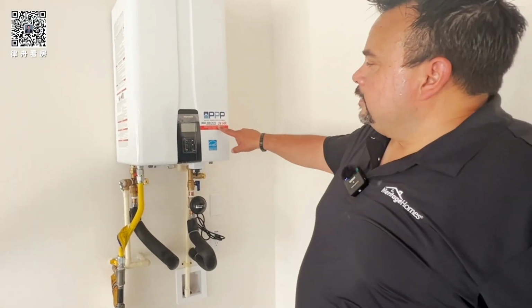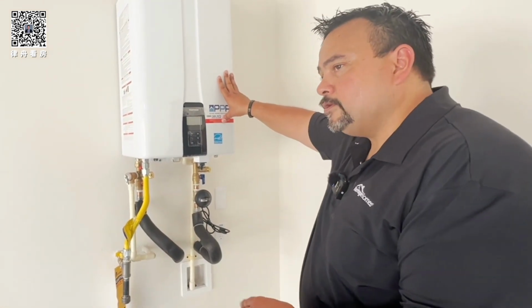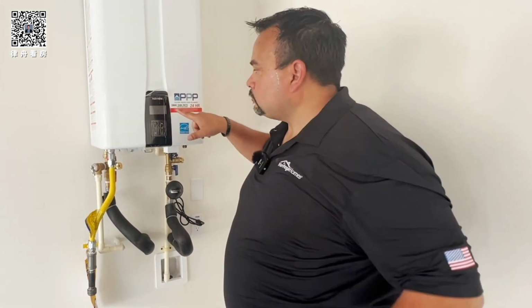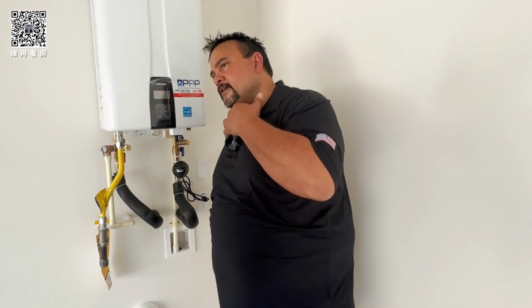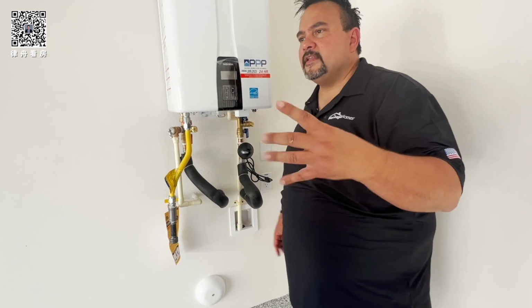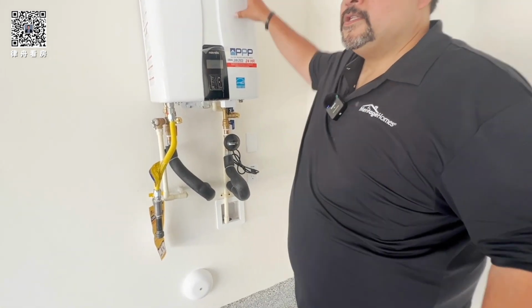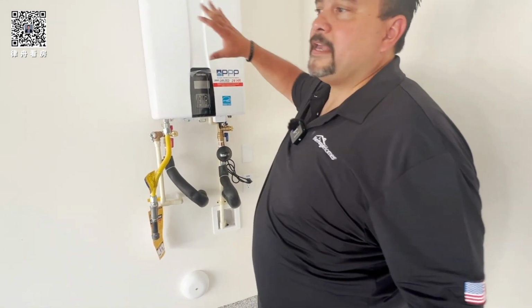So this plumber, they do service, right? You can do it, or you can have the plumber do it, but one time a year, the manufacturer, Navien, they recommend you do a tankless water heater flush. Do you drink coffee? Sometimes. In a coffee pot, you put water, right? It gets ugly inside, white, right? Calcium. Same thing with a water heater. So you clean your coffee pot with white vinegar to clean it out, right? Same thing with this, they clean it with white vinegar to clean all the calcium out.